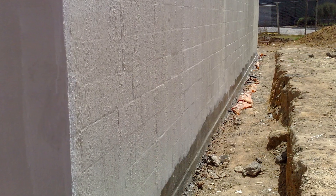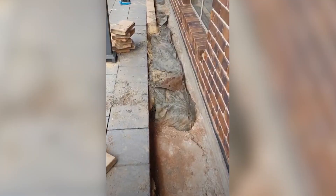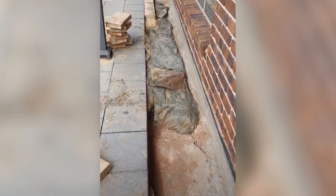Ideally the concrete footing should look like this - a nice wall with a nice L-junction, slab edge and footing edge, where you can get our butyl fillet in there or put a fillet bond breaker and proceed ahead. However, they often look like this, and the issue is how do you prepare it?